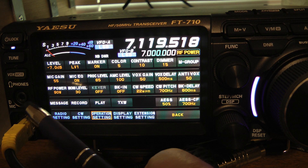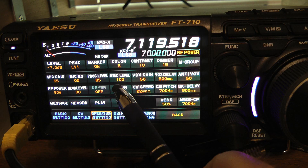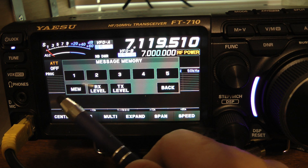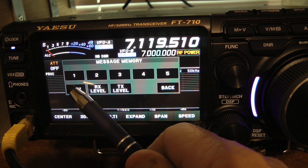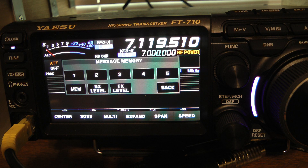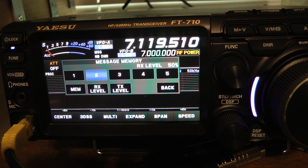One other thing that's really neat about this radio is the voice message memory. This is where you can record a CQ call into the radio. When you do your recording, make sure break-in is off, and when you're ready to send the recording over the air, make sure break-in is on. I have already set up memory channel one, so we'll set up one of the other memory channels. To record, hit the Mem button, then hit what memory channel you want to record into — I'm going to do number two. Push the push-to-talk button and it is recording: 'This is a test recording, testing one, two, three.' When you unkey the push-to-talk, it is recorded.